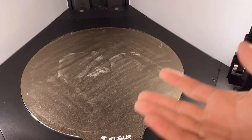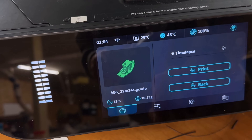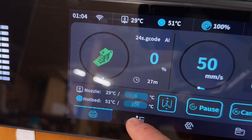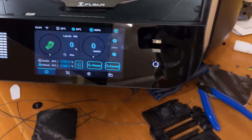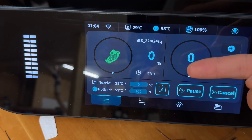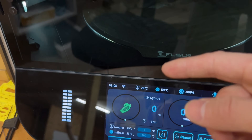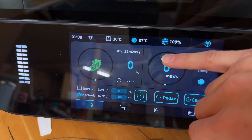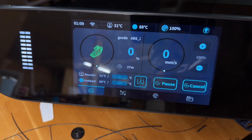I've got glue on the bed because unfortunately I can't get ABS or ASA to stick without it. I've also modified the G-code file so it heats up to 100°C on the bed first before bringing the nozzle up to temperature. Their stock G-code tells it to heat up the nozzle and bed at the same time, which causes the nozzle to just ooze because this bed takes a while to heat up while the nozzle heats quickly. Changing that fixed the issue completely. The clock shows 27 minutes, which must account for the bed heat-up time.